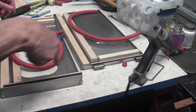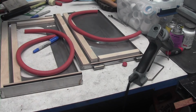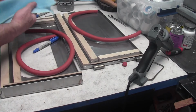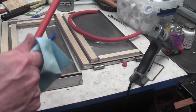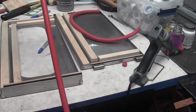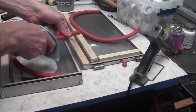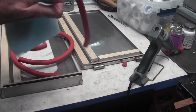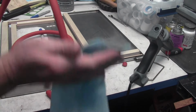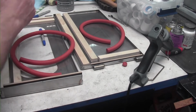Now I'm quite certain that these are nice and clean because I just ground them with the belt sander. So I'll wipe these down with a little denatured alcohol, even though they may look like they're clean. It's probably a good idea to wear gloves doing this too, because even wiping it down, getting the oils from your skin on it is not a good thing. So I'm going to go grab the silicone adhesive remover, and then we'll give them one final wipe down using gloves.